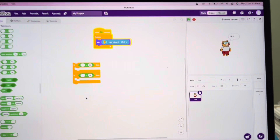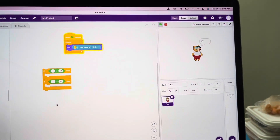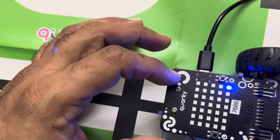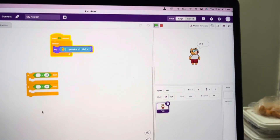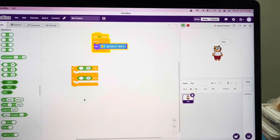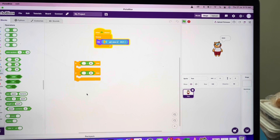Here is the Corky and this is its right sensor. At the moment the sensor is on white, so the reading is below 100. When I move the sensor towards the black line, the reading changes — it goes beyond 100, up to 1100. So the right threshold we can take is greater than 100 or 200, but less than 1000 or 500.